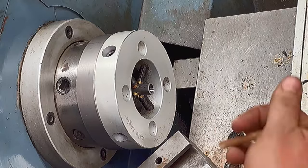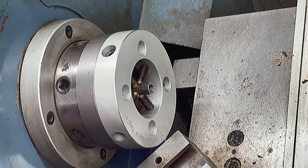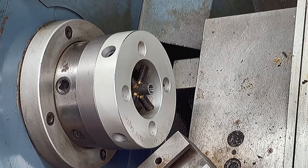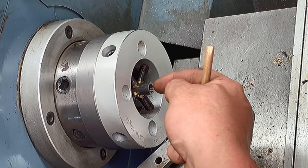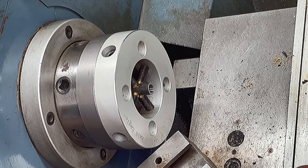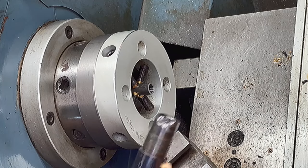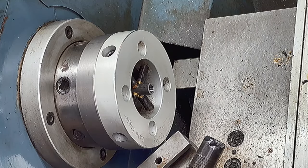So we ended up chambering this flush. The reason I did that is because this barrel liner is going to sit flush where the 4570 case was rebated. So I didn't want to rebate the cartridge head into here, because then I would come over, have a step up, and then back down into the next cartridge. So this one will have it so the barrel will come flush, or wherever the headspace ends up, and then the cartridge will sit on top of it. Hope it was the right decision. We'll find out. Last thing I'm going to do is polish the chamber, and then we'll pull that liner out.